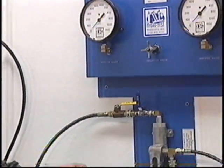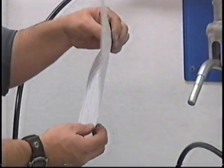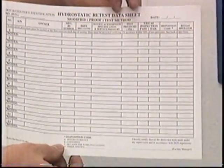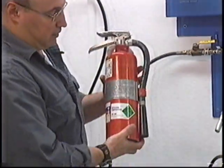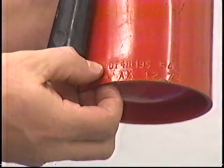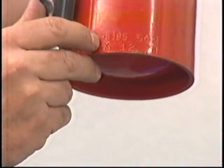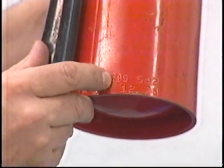Hydrotest Products has produced a calibration verification sheet for proof testing, as well as a retest data sheet for proof testing. Keep in mind that if you are retesting DOT-rated fire extinguishers — for example, this cylinder is a dry chemical cylinder that is DOT-rated — you can see that it's a DOT-4B195. That specification 4B will tell you that you're going to test that to twice the service pressure.